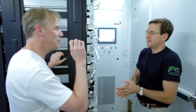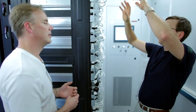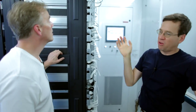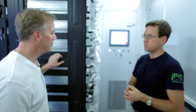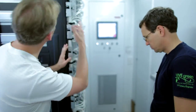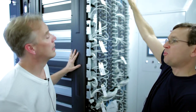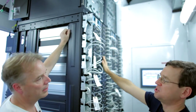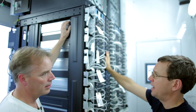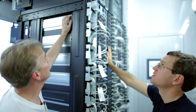So this has been your baby for a while — you've engineered these steps, really come up with how to tune these pieces together. The big thing about pods for us is it's the end-to-end converged infrastructure — literally from the server to the fans overhead, including the UPS, to the chiller, even up to the 4,000 amp input feed. We actually do in-rack UPS, which is significantly cheaper than facility-level UPS. There are two of them at 12 kilowatts apiece, with about four minutes of run time. The idea is to basically flip to generators — you've got plenty of time for these things to go over to generators if you have an issue.